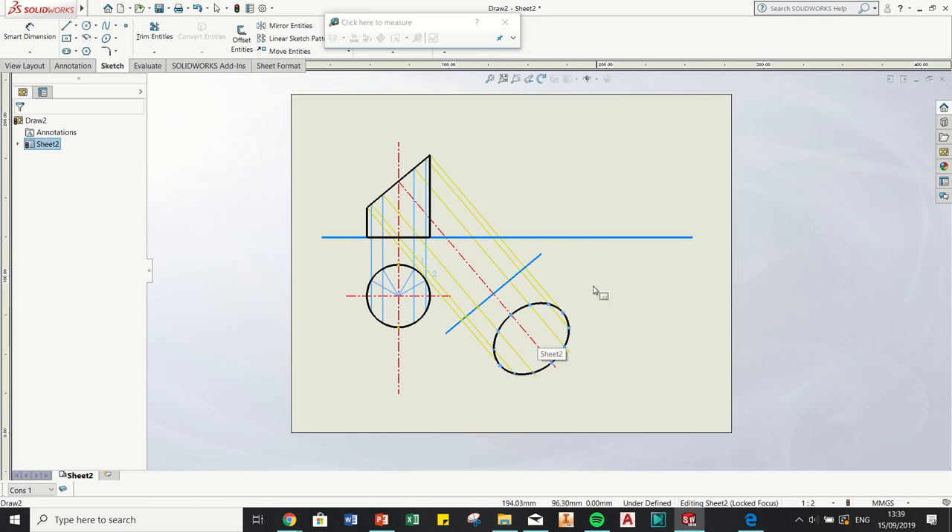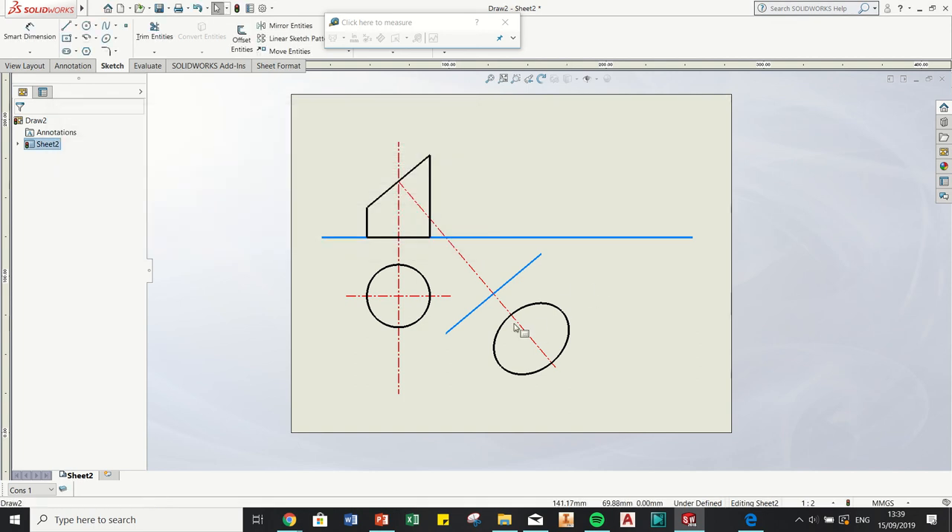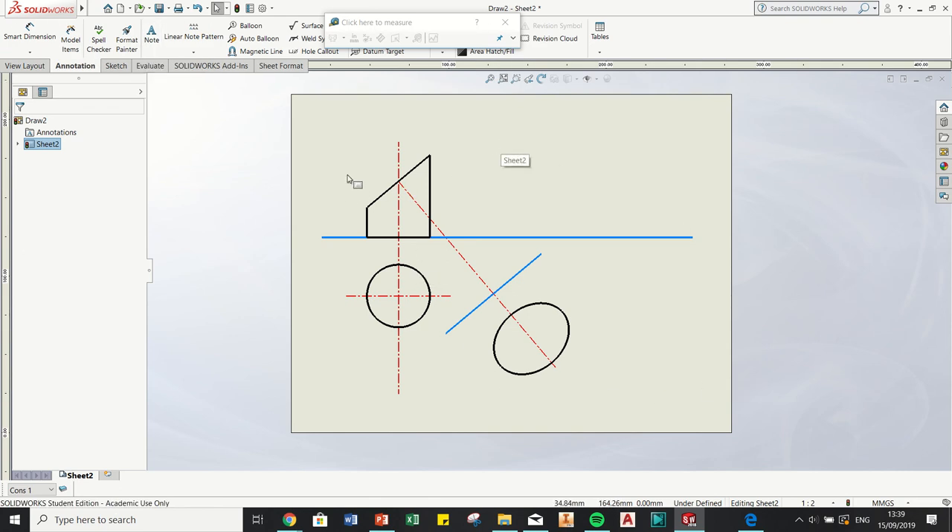The drawing is finished. You could draw in your center line down here, make it parallel, and snap to the midpoint. Draw in the x1y1 line labels, label the elevation and the plan. You can turn off your layers - just click the eye icon to toggle them - turn off the two construction layers and you can see the drawing more clearly. Label everything with annotations and notes, add your title box, put in your dimensions, and that's the basic approach to drawing it. Thank you.